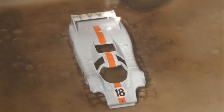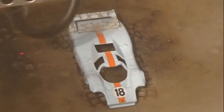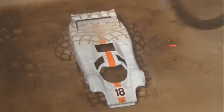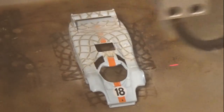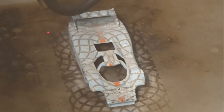Here you can see it sped up several times. For this custom, I chose a simple black and white bitmap pattern I downloaded from the internet — I find this works best for paint. In other substances like wood and leather, the laser can put in gradations by changing the laser power, but this doesn't work on paint, and I'll be painting over the image anyway. The laser has two modes: the raster mode I'm using right now, and a vector mode used for cutting. Raster mode works like a printer starting at the top of the image and working down, while vector mode works like an old plotter drawing lines from point to point. Both modes work on the paint, and both have advantages and disadvantages.